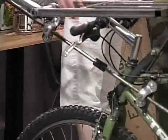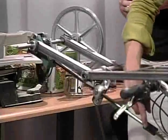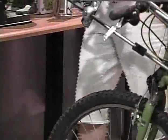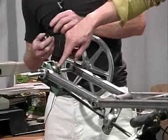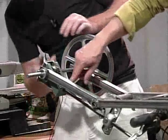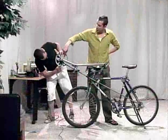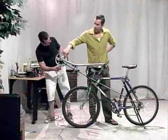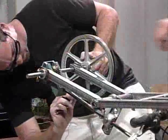Okay, so what we've done is we've dropped this coupler into here, which now engages this component, which is a worm gear system out of a skill saw. And so this now is transferring energy here, and then once again we're going 90 degrees of the drive power into the PTO shaft here. So once again we've changed direction of power transmission to 90 degrees.